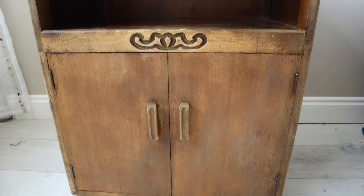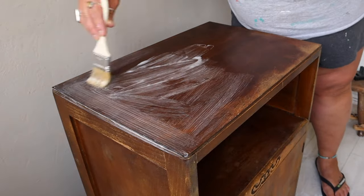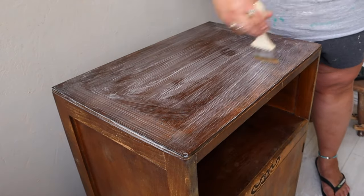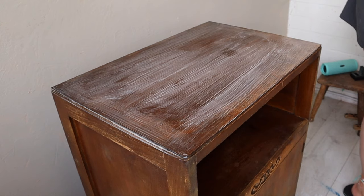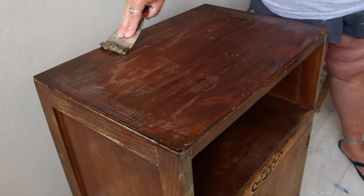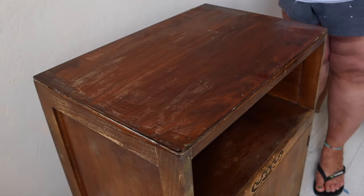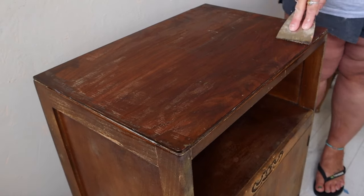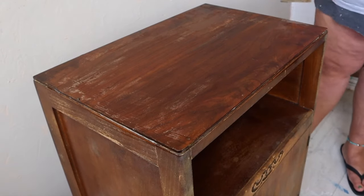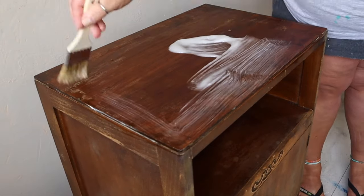After the oven cleaner, the doors came off slightly better than the top, so I just went in with the big guns and used a chemical stripper. I didn't want to sand at this stage because I was at risk of blowing through the veneer. This is a cheap and cheerful stripper from Wilco — less than ten pounds. I did two passes on the top as it was the toughest area, scraped it off with a sharp scraper, then reapplied another coat.